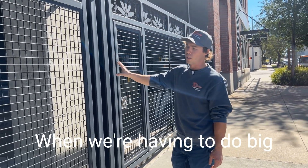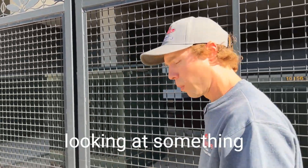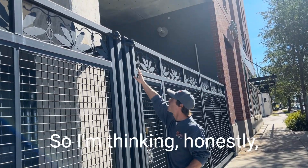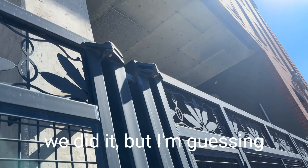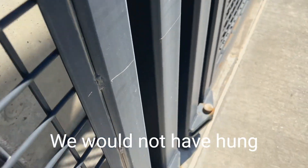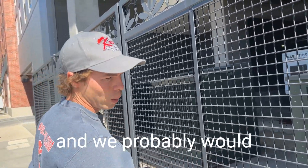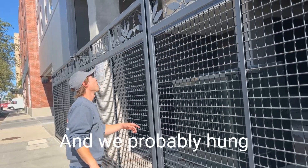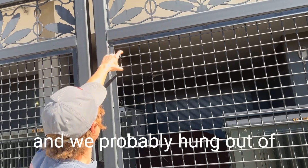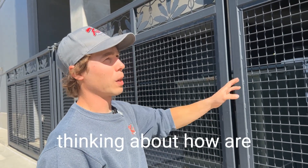When we're having to do big fence pieces like this — and this is obviously a pretty big piece, it starts right here and comes all the way over here — I'm always thinking about how are we going to fit it in our booth and our oven, and how are we going to hang it? We've got some pin joints and hinges over here. I don't remember exactly how we hung this, but I'm guessing we went out of where those hinges are and hung it along the other end. I think we actually laid this down horizontally and hung out of each one of those points, probably out of the drop pin holes and around one of these other areas. When I'm quoting big stuff like this, I'm always thinking about how are we going to process that.